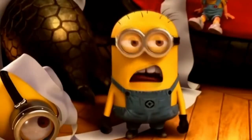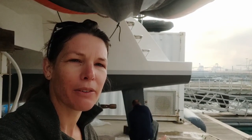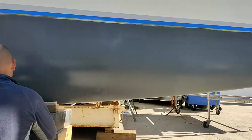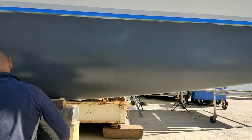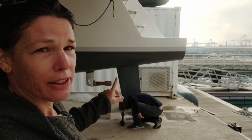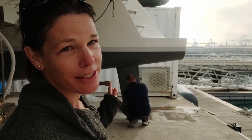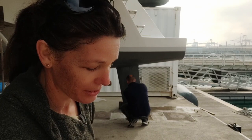You don't know what your children have been doing? I can't remember. As you can see in the background we have painted the rudders, put some prop speed on the propellers, and painted the bottom of the hull so it has its antifoul on. The last coat of antifoul is going on today because tomorrow we're going back in the water. The sail drive is taken out — that's the second one that Shane's taken out, cleaned and serviced, which is the one you saw at the beginning of the video with the kids starting that process.